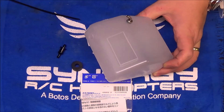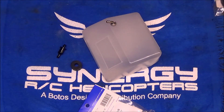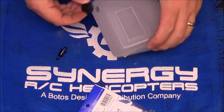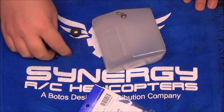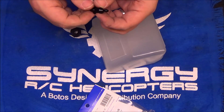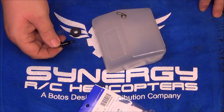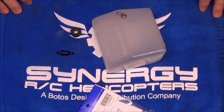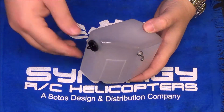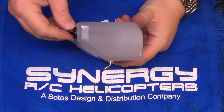I'm going to cut the camera, get my bubble-less clunk out, get the clunk line measured to 90 millimeters, and get the clunk installed in the tank. This grommet is pretty straightforward — shouldn't need any sealants or lubes. I will put just a tiny bit of synthetic grease on the end of the clunk adapter to push it through the grommet easily, but just a very little bit — I do not want to risk contaminating the fuel. When I come back I'll have my tank ready to install. Fuel tank is finished — vent tube is in, main grommet is in.